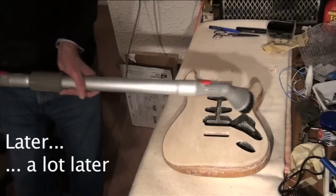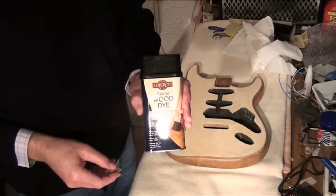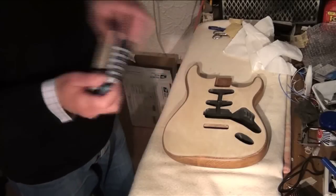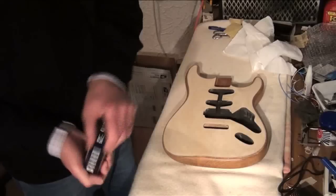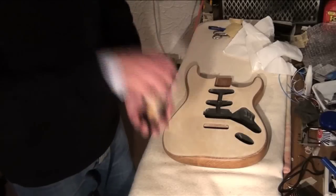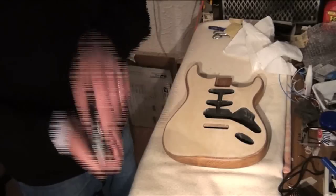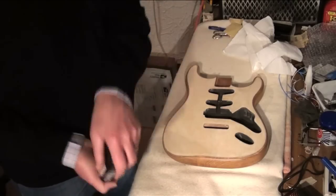I've done my sanding down. This is a good time to get rid of as much dust as I possibly can. This is a water-based wood dye — it's a good idea to give it a really good shake before you get started so that the contents of the tin are distributed evenly. I paid particular attention to the area that will end up under the scratch plate, partly because I really dislike it when you take the scratch plate off an instrument and all of a sudden see that it's not as well finished as you thought. But another reason is that under the scratch plate there is going to be my test area for the dye — the moment of truth that will tell me if I've got all the oil out of the wood.